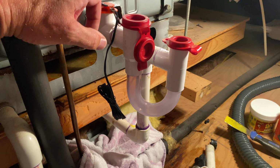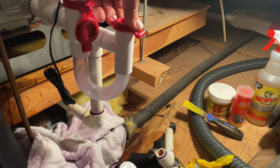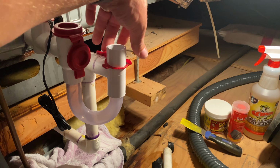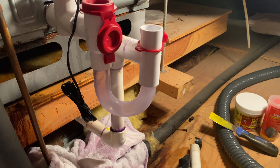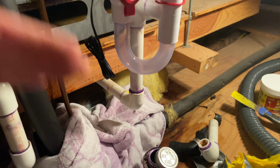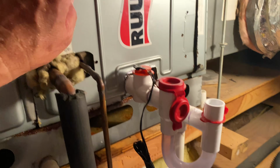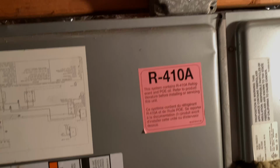Okay. The inlet side of the trap. Clear trap. We're going to leave this open. I'm going to put a little pipe up here for venting. Helps the drain go down. Okay. And I have a short little nipple in there, and then a new 3/4 elbow pointing down, and this was dipping down before, so now everything's slightly pitched down. So I think that looks pretty good. Let's take the cover off. Actually, let's take off this cover.